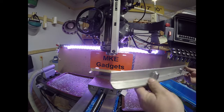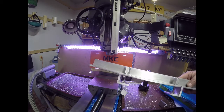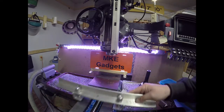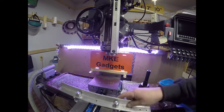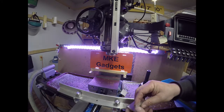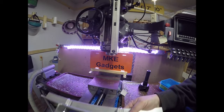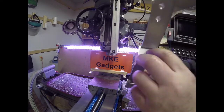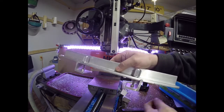I rounded the corners, found the center of it, and drilled two holes for these little clamps. This slides over on the tee of the vise and then you can position it front to back. The first clamps I made I just milled them parallel, but they got cocked sideways when sliding on. So I made new ones and put a notch on there so now when you slide it on it won't get stuck sideways.